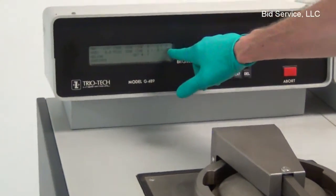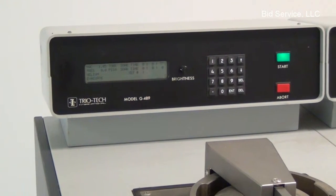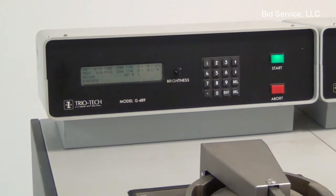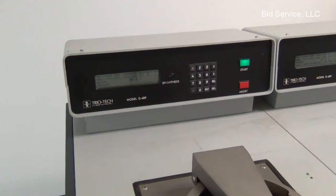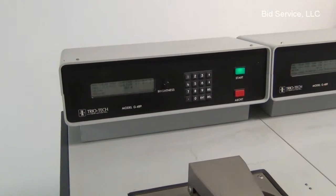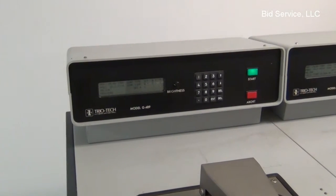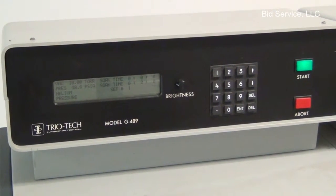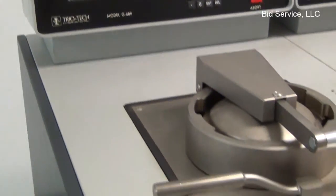See here, it went past the 5, so it began timing. We're at 44 seconds now in the vac soak. Okay, got it. Oh, now we switched over to the pressurization. You see the pressure going up. It slowly increases. Once it hits 90, it'll start the soak timer. And you also have your gauge down here, your main tank gauge. You can see that that is increasing.